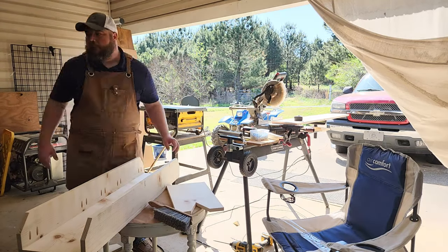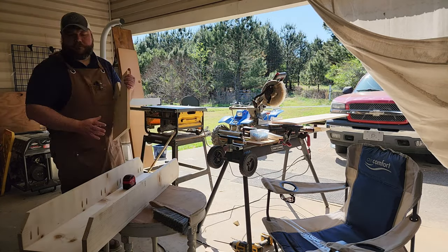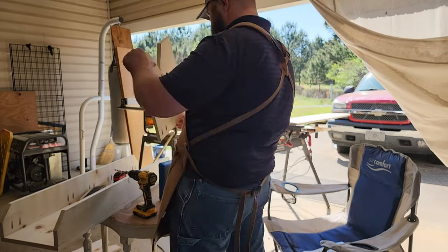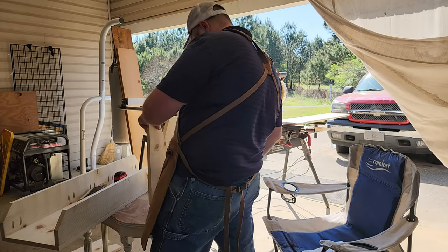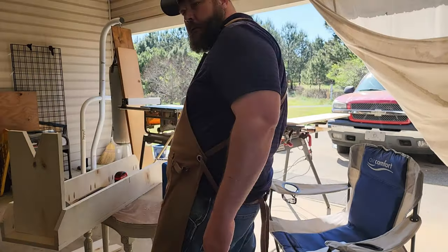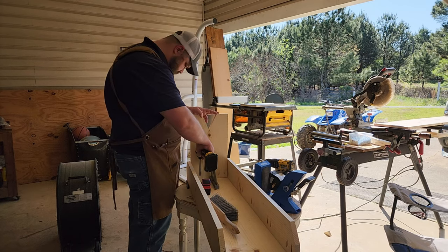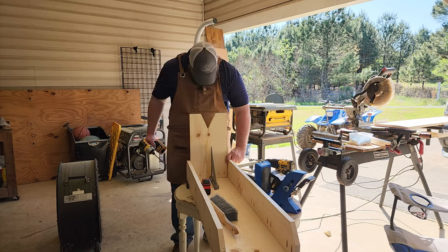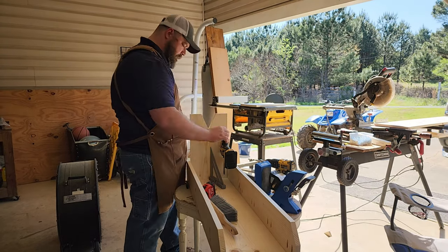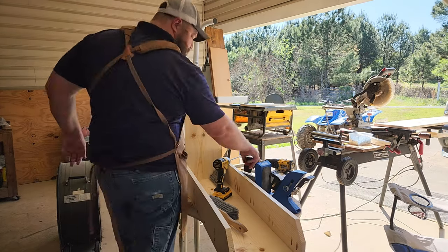I'm checking it to make sure my width is correct and I'll mark my spot so I know exactly where I want to put it. This one is one of those where you measure a couple of times. You want to put a screw in one corner first — just one corner — to make sure it locks down in position, because if it doesn't, you'll need to go to your secondary Kreg hole to move it. You'll see in a minute where it doesn't line up properly on the first try. I remove the screw and then put in the second screw in exactly the right position, using a speed square to make sure I stay straight up and down.